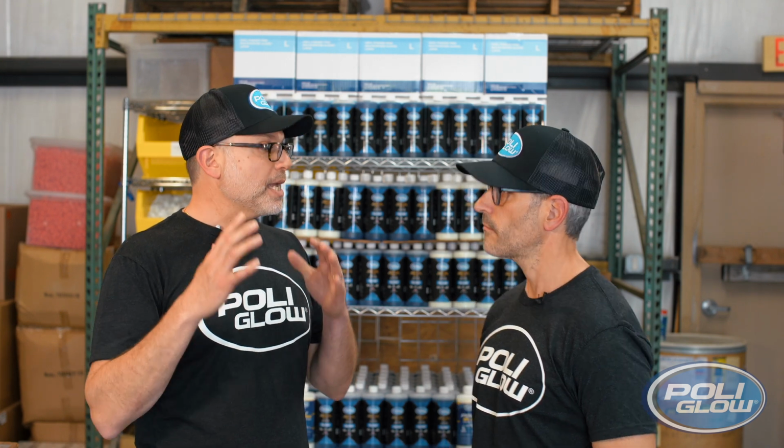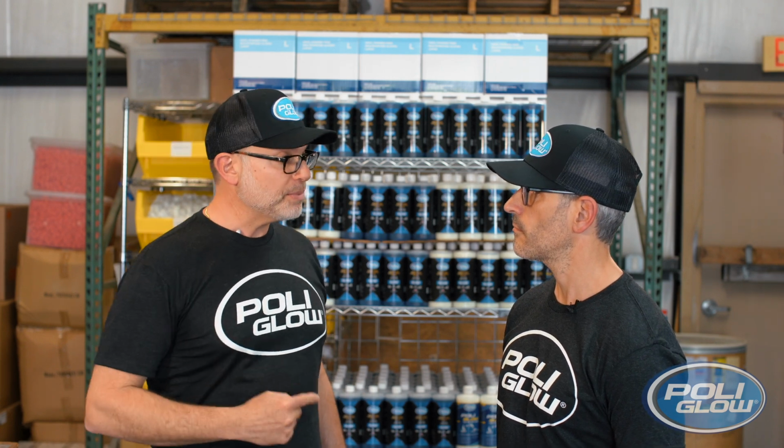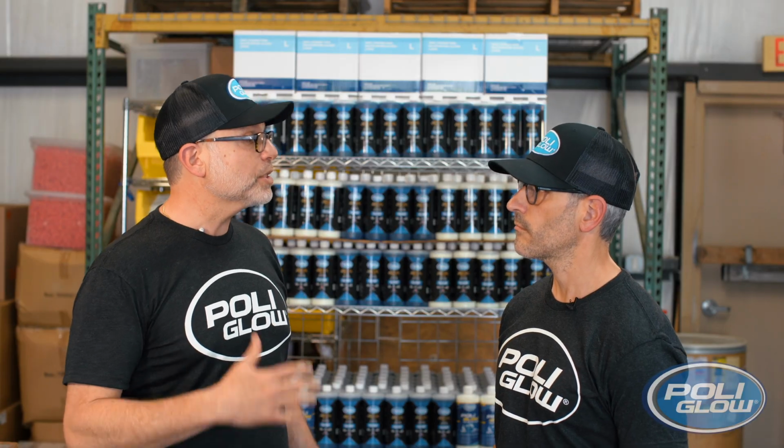We have talked before about temperature and humidity. And I know this is really important. It is. So again, remember, temperature and humidity are going to change how you apply Poli Glow. If it's hotter temperatures and lower humidity, it's going to dry more quickly, and so you don't have to wait necessarily 2 full minutes. But if it's cooler temperatures and higher humidity, it's going to take longer to dry. And so you really have to be careful that the finish is dry before you apply the second coat, or it's going to get streaky.